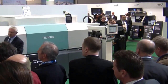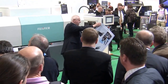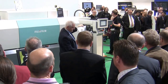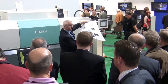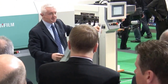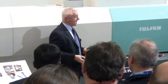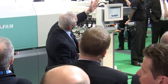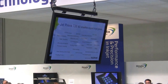The first job is a mix between offset litho and digital print. Our customer is producing a national campaign but also wants to personalise some of the publications for local German towns and cities. Look at the ink presentation on the paper here and compare that to the JETPRESS 720 — near identical. The benefit for our customer in mixing offset litho with digital is that with the shorter run work, he's able to save production time and also reduce the number of offset processes, costs and consumables. If you look on the screen, these are all items that contribute in the world of offset litho printing.